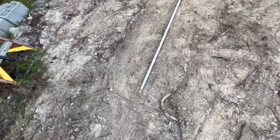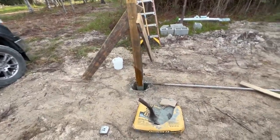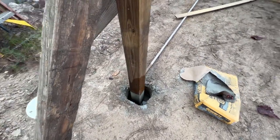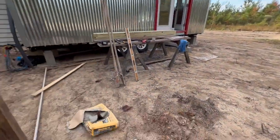It's probably going to hit a million roots and this stump might be in the way. I didn't bring any kind of saw to cut roots, but I do have my loppers. It's right on line, perfectly level. I put about three inches of dry concrete down there and threw some water on it just to keep it stable. I won't mix in the wheelbarrow until I get all four across the front done.